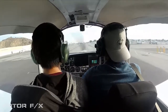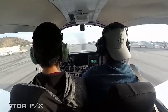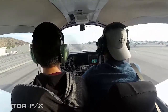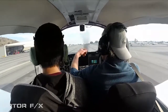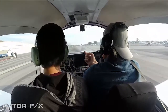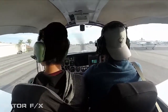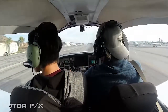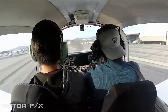Now we're going to go straight down past that car. I'm going to show you how to make a very fast 180 turn on the ground, but we're going to get past the car. That's a Channel 4 helicopter, they maintain it here. They're fixing it. Now look back, make sure nobody's coming, all the way back. Anybody coming? Negative? Good. Now when I tell you, press top of the left foot very hard. Press top of the left foot all the way hard. Notice how fast it turns? Let go now. Top of the right foot. There you go.